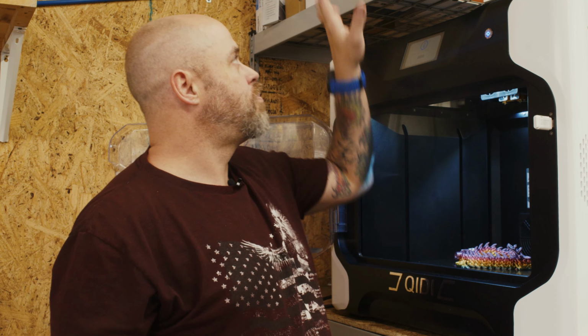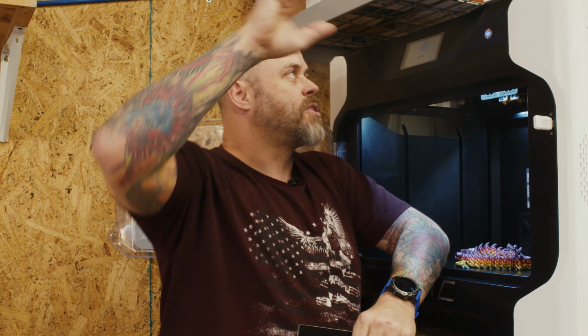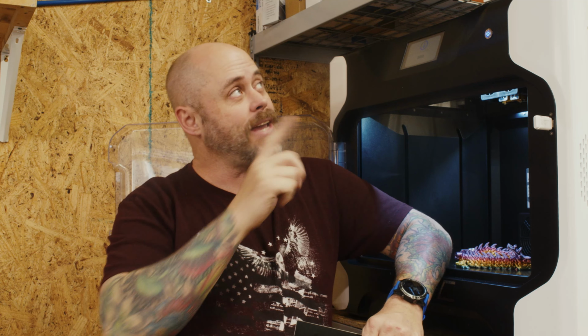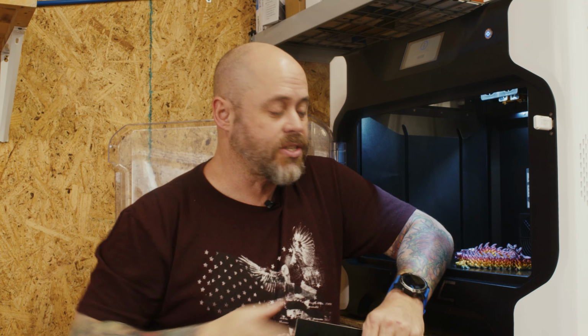It seemed to work okay at first, but then it broke. I think it's just because it was a little bit too much drag on it. It was pulling a little bit too hard, too much at an angle. So I reconfigured it and changed it around so it's not going to hit that. It's a shorter Bowden tube, just one quick little arc out and in. Makes a big difference. Plus, printing out of the dryer versus the one that came with the iFast.